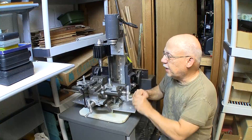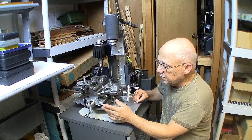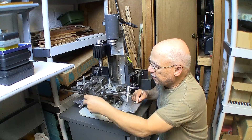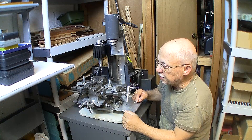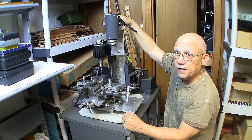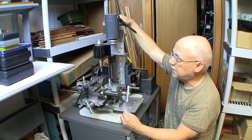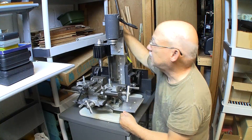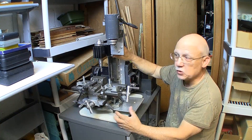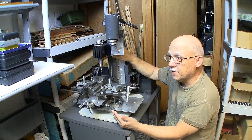Now it operates perfectly well. I created stops for the X travel and the Y travel that you see here. And I'm using a simple vise normally used in drilling or drill presses. The Y advance is screw fed from above — one revolution advances 100 mils. It has a lock so that once you set it you can lock it in place and lock the spindle and motor assembly so that it does not move whatsoever. It has the accuracy of about one thousandth of an inch. I have already determined that.